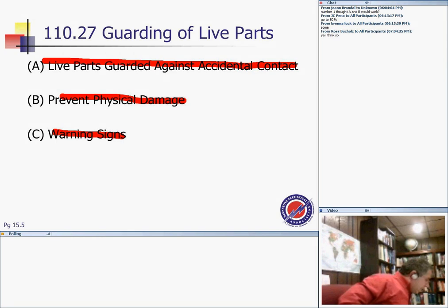Permanent substantial partition or screen. The most common one, guys, is by location in a room, vault, or similar enclosure that's accessible only to qualified personnel. Entrances to rooms and other guarded locations that contain exposed live parts shall be marked with conspicuous warning signs forbidding unqualified